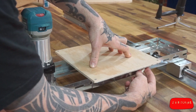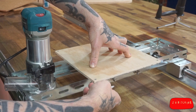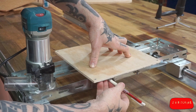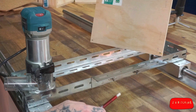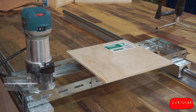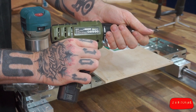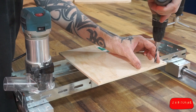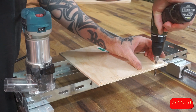Then I take my camera platform and trace the L-bracket holes from underneath. Once it's traced, I flip the board and drill slightly oversized holes with a brad point bit. If you care about tear-out on the other side of the board, lay it on a sacrificial piece of wood. I'm mounting cork to the other side, so I'm being messy. Later on, I changed my mind and decided to drill new holes so that they'd look more centered. Like I said, lots of mistakes on this one.